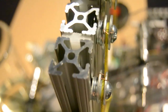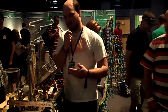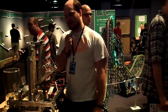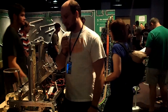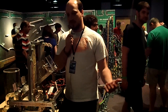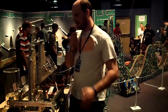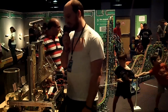Overall, the lift is overly heavy and a little slow because it's geared and designed for a lift that would lift a robot up from last year's game. There are a lot of modifications and tweaks you'd have to do to implement this in a competition robot. It takes a bunch of engineering to get it to work right, but it's possible. There are also a lot of failure points in general — each joint can fail, each bolt can slip, each bearing can slip. It's a very complex design; it looks simple on the outside but it's not.